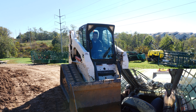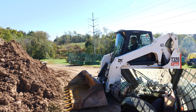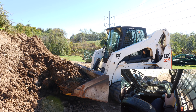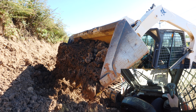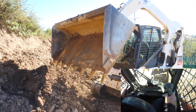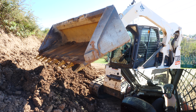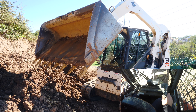I'm going to start the machine, run into our test pile of dirt and talk you through some of the things I'm doing and sensing in the way the machine responds. This is our test pile and we're going to bury into this thing and try to get it packed good and full. Generally what you're going to do in one of these machines is dirt work all day, transporting to another location and going to dump. If your dirt is really wet, particularly if you have a curved back bucket, you can get dirt stuck in the back. You come out, lift the machine up, and shake the dirt out — see how I'm shaking my stick back and forth and my bucket's hardly moving.